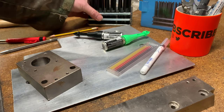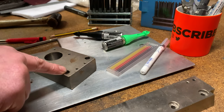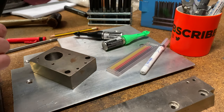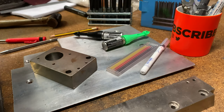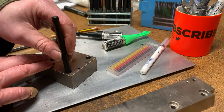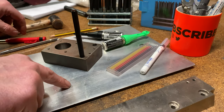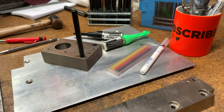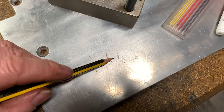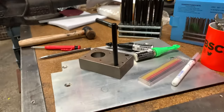If you want imperial they're a little bit more prevalent — you can get a lot more of those. Let's just try one. The hole in the block is about nine mil I think, so you want to pick one that's a good fit. There's no good having one that's rocking around because you lose your accuracy. So we go for nine mil — good fit, hold the metal, tap, and you've got your mark. I didn't hit it very hard because I'm going to come in with a proper centre punch and knock that out so I can drill it if I wish.